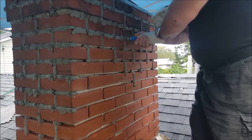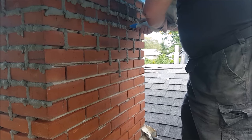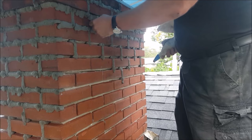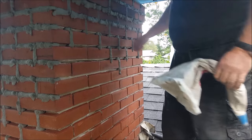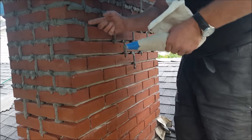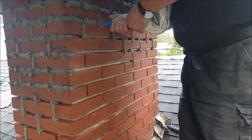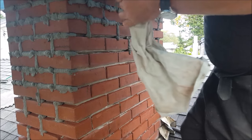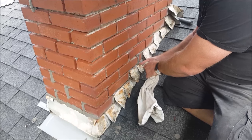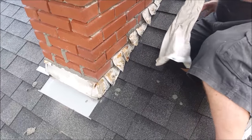I'm squeezing with this hand first, then squeezing the back hand to push the mortar forward so you get a rhythm down. The mortar that I'm squirting in — I'm coming out past the face of the brick fairly far because I need some substance to tuck in, into the joint. This mix is loose enough to where it's filling the whole joint, but you still have to come out about a quarter inch past the face. When you've got just a little bit of mud left, go down low on the structure — it makes it easier to work with in a tight area. Just alternate back and forth as your bag gets low.